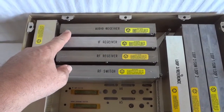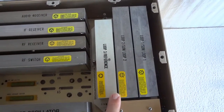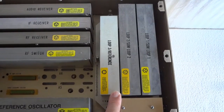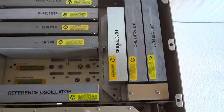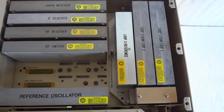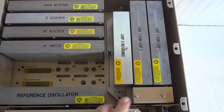Audio unit for the receiver, IF unit, RF unit, and an RF switch unit. This is the synthesizer — three modules for the synthesizer. It's basically a fast DDS synthesizer built with discrete TTL chips. It had to be a DDS in order to do the frequency hopping — only a DDS is fast enough for that. So in the 80s when this unit was designed, that was pretty unique. It didn't have single-chip DDS's yet.